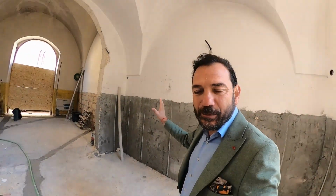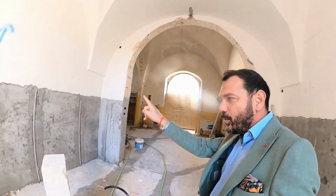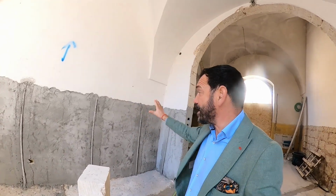So the decision was made. The first part of the job after it's hacked off is to apply the dehumidifying plaster as a rough coat. It fills up all the gaps. But then you are thinking, what are these bars? Well, I'm going to show you the bathroom upstairs, but these are very important to fit. In this particular case, we're not tiling, but still, cabinets are going to go across. So it's important to have a wall that is dead straight.